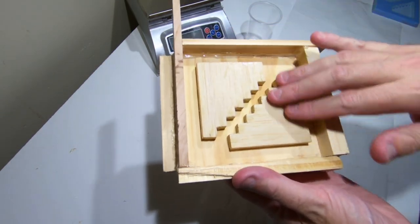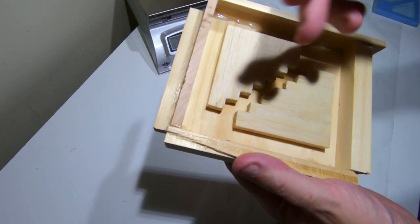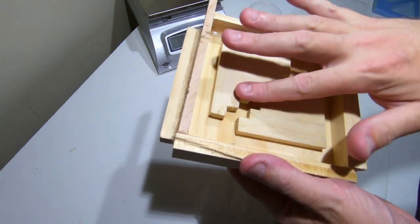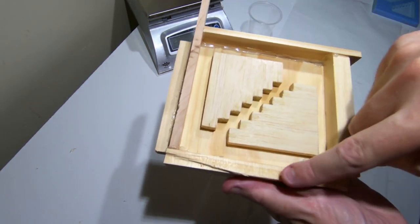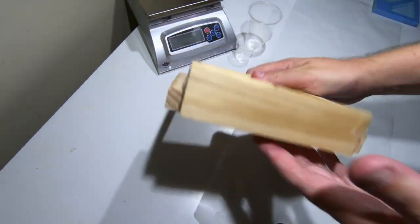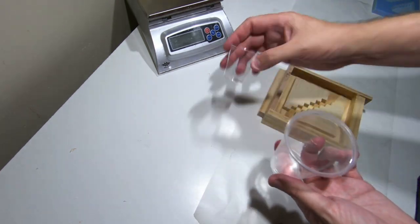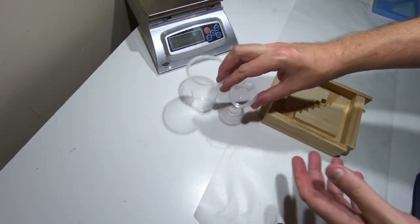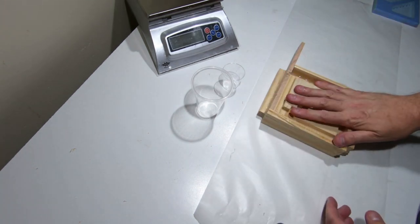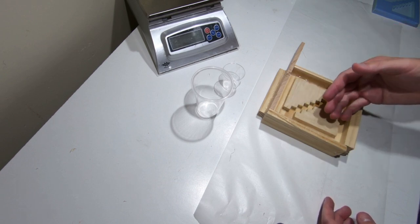It's very simple — these are made of wood. I've put a resin over the top of them and sanded them back lightly. Normally they have little tiny grooves so the wire goes over the top, but this time I decided to make them flat, so I filled those bits in and put some wood up around the edges and glued the inside so the silicone's not going to leak out. I'm going to make up some silicone, add it to the cup, add the catalyst with some mica so I know the catalyst is mixed in, and then pour it over the top.